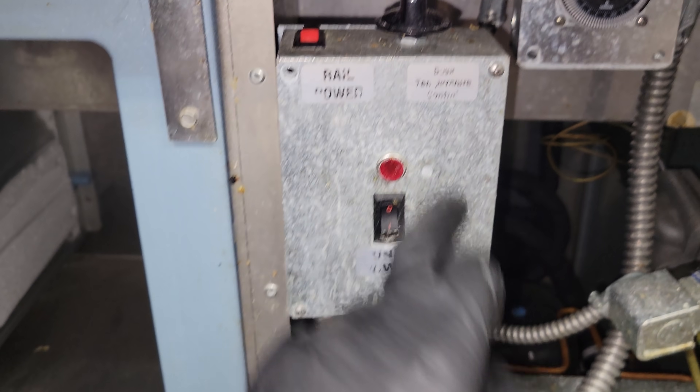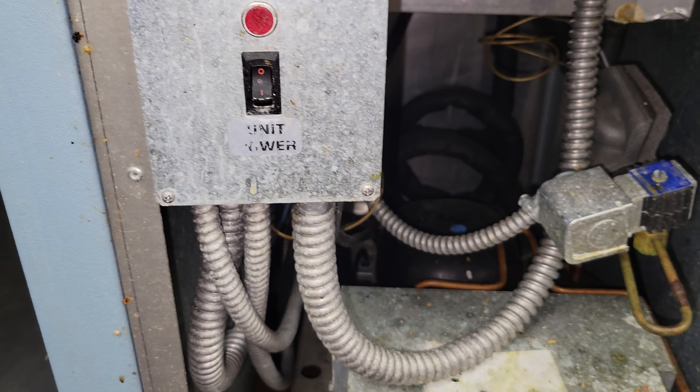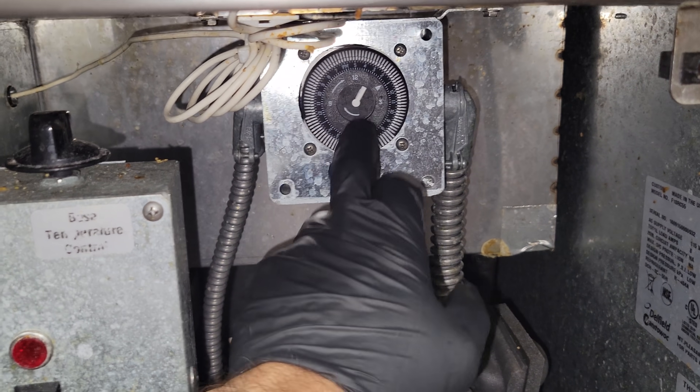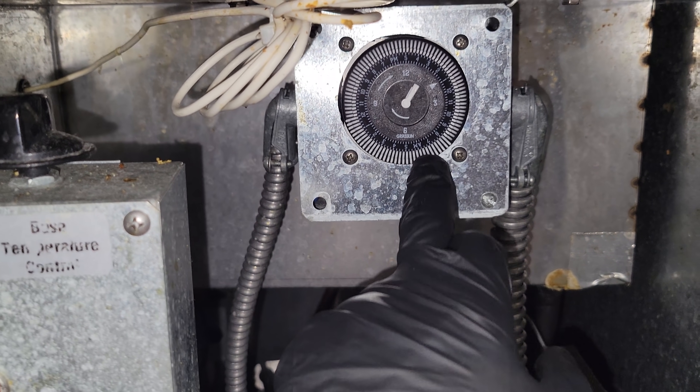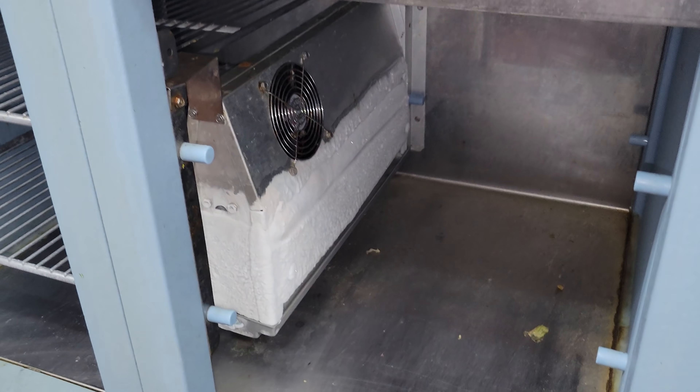It's just kind of a silly setup. I like the ones better where they have two separate temperature controllers for the top and the bottom. They also have a defrost timer right here — that's actually just an off-cycle timer and it's only for the top, so it does a shutdown from midnight till 8am. That just shuts off the top. They're not supposed to be leaving any food in the top at night time — they take it out and put it in the bottom.